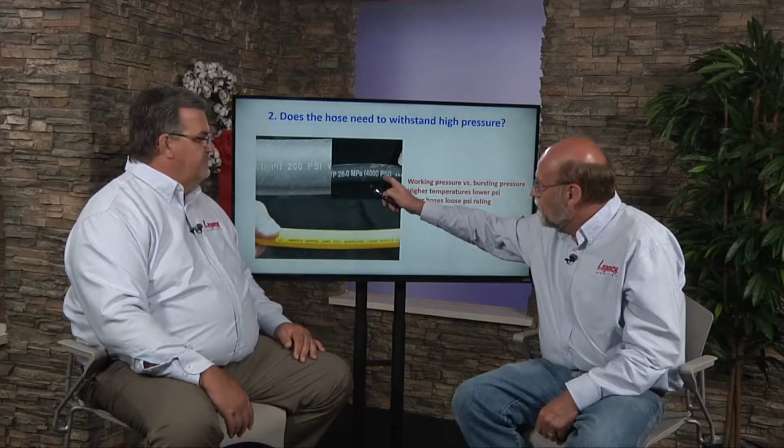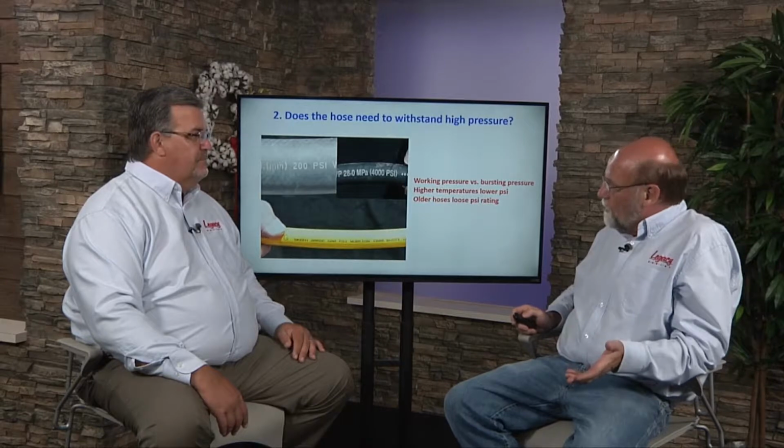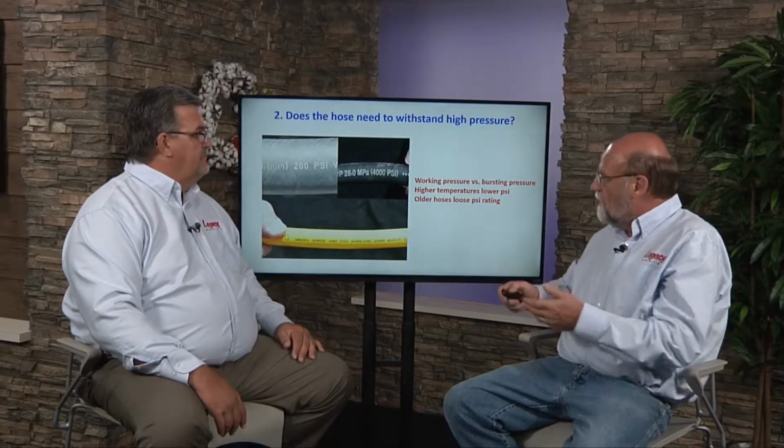So if you told the person behind the counter, I need a hose that'll carry 600 PSI, and you carry that home, fine. But if it's not prepared for the burst at 1,800, you're broke down again. And with these kinds of hoses, when you lose a hydraulic hose, people can actually get shot through the hands. These are extremely high, dangerous pressures. So that's another component: what does it carry?